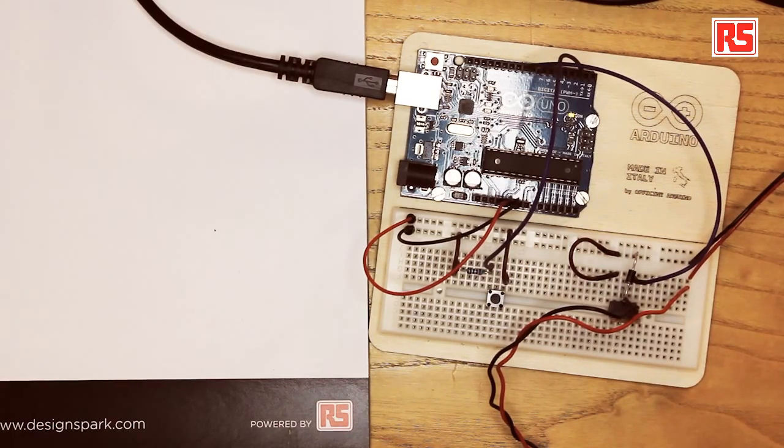What are the issues we have to take care of? The DC motor works normally at more than 5 volts, which is the standard voltage that Arduino operates at, and it requires more current than a single Arduino pin can provide. We can hook up a regular LED to an Arduino pin because the current it needs is low enough. But with the DC motor, it requires much higher current and we risk burning the Arduino pin if we try to hook it up directly.